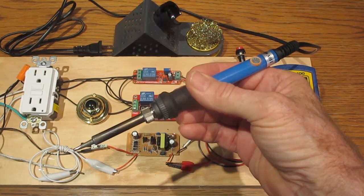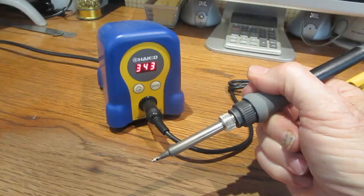This video is a demonstration of a way to get temperature control on a soldering iron without a heat sensor. Soldering irons that have a heat sensor are powered with a controller. The controller sends power to the soldering iron in long or short pulses at full power. The frequency and duration of the power impulses will vary according to the temperature of the sensor. In this way, the temperature of the soldering iron can be regulated in a very precise way.